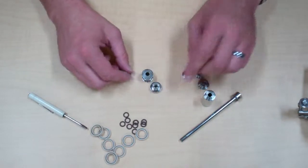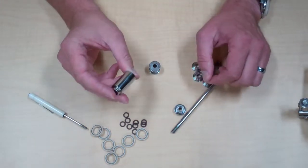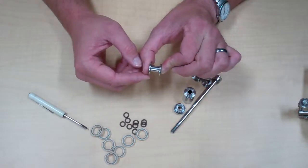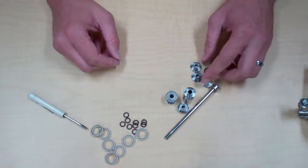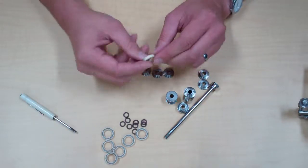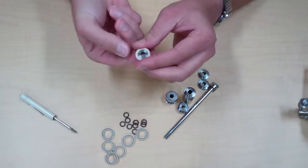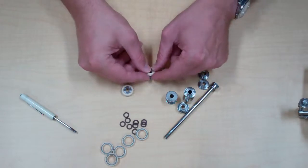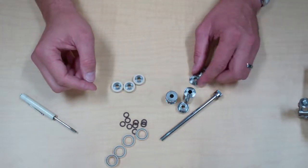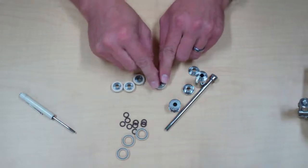The plunger consists of the seal carriers — one of them is a thicker one, that's the last one — the sleeve, which is a spacer extension or just a longer, thicker carrier, and the annulus, which determines the sample volume of the sampler. For the first three carriers, the seal goes onto the carrier with the spring facing the shoulder. For the remaining carriers, the seal goes on with the spring facing away from the shoulder.